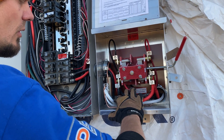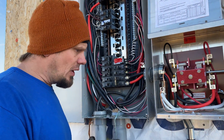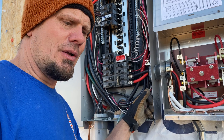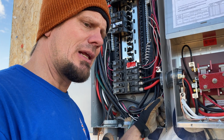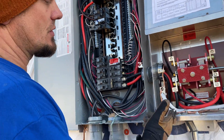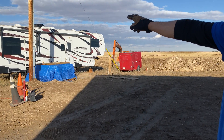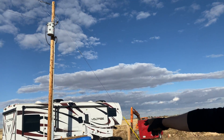If you're looking for a do-it-yourself kit with six circuit spots, that's up to you. But on newer homes from 2002 up to 2021, we have neutrals involved on the dwelling areas. When you use some of those kits, it takes out the neutral. You've got to keep in mind — this is all about the neutral, to make sure it's fed properly. What I like about this switch is the neutral does tie together and bond, and it goes out to a disconnect on that pole. We're no longer allowed to have two breakers out of that box, only one. And that transformer is grounded.